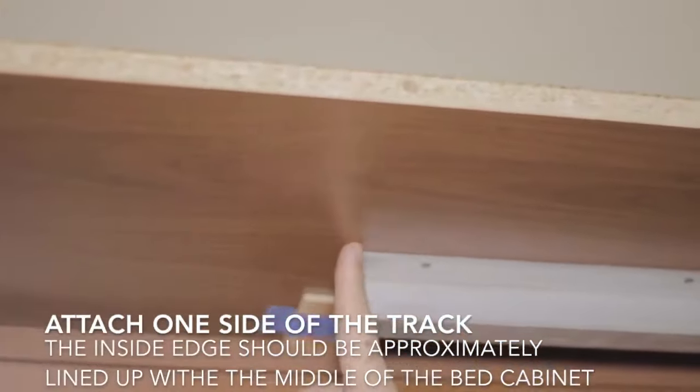Adjusting the bookcases is now much easier — from below, those roller posts should have a slot in them and you can adjust the angle of the bookcases by simply turning those posts with a flathead screwdriver. After this you will add the valances that wrap around the entire assembly. These use pins and cams to attach, and you want the side that is longer in regards to where the pins are placed facing down. You attach the left outer and the right outer first, and then the left front and right front to those and the front edge of the library top.